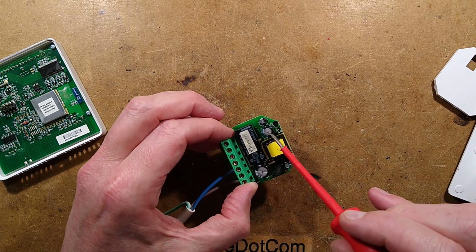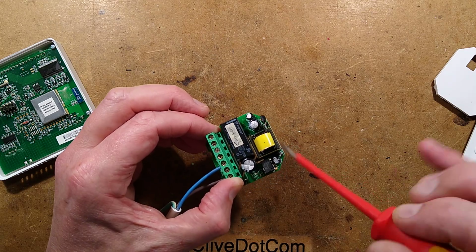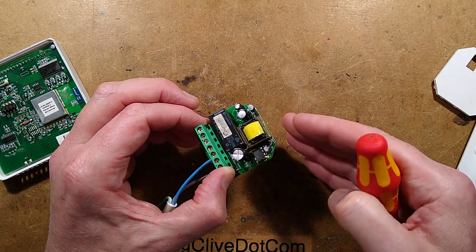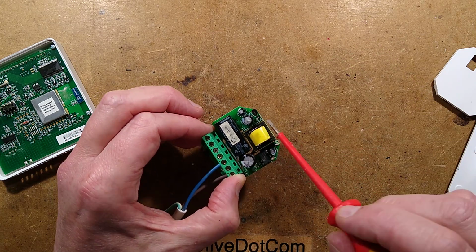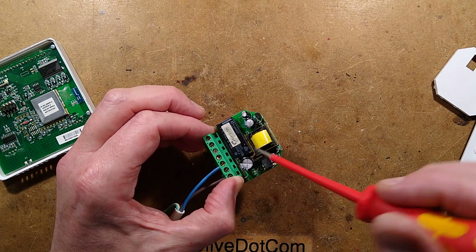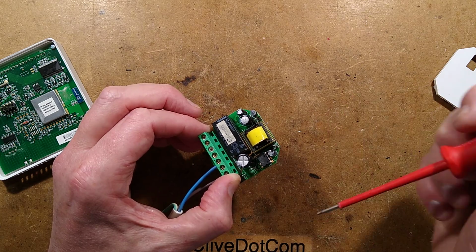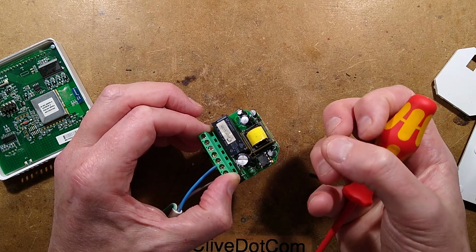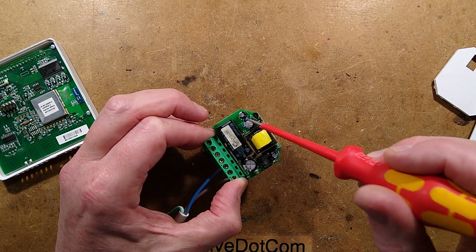It's the curse of these power supplies that because the output capacitor is run at very high frequency, it dissipates a lot of heat because it's seeing current flowing in and out of it at a very high frequency. It just adds up to a lot of dissipation. If the electrolyte fails, and it has to be a specific electrolyte for that, it causes gas to form inside, which causes the doming and also damages the ability of it to act as a capacitor, so it tends to go a bit odd.